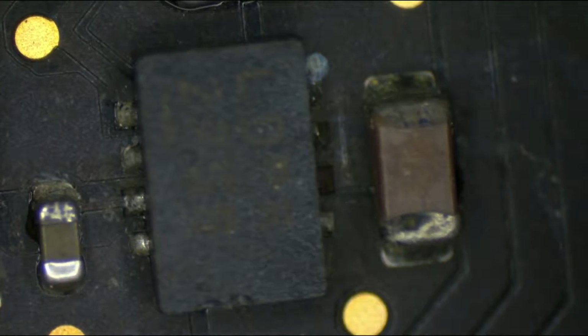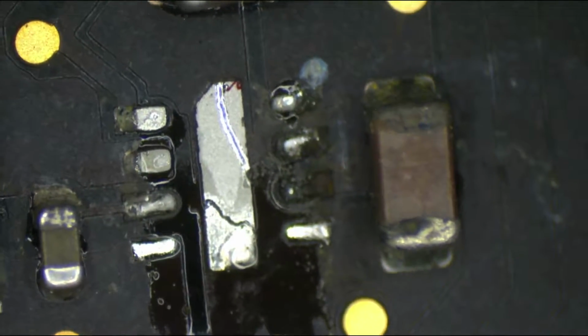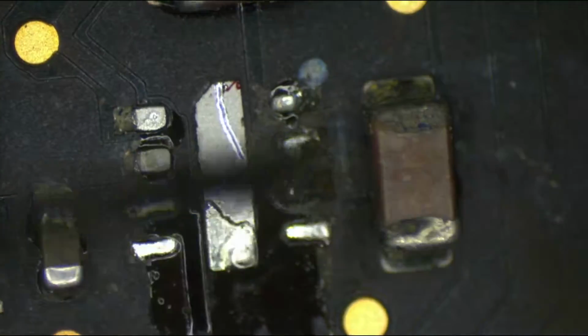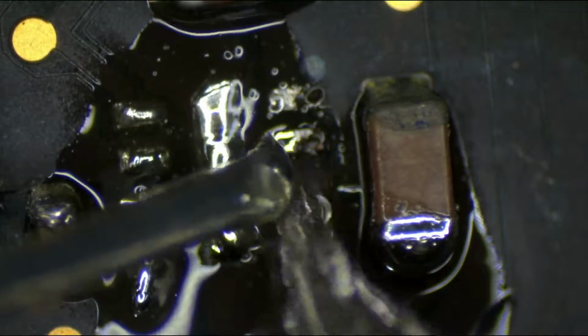One of my pet peeves about Apple products is they all have this circuit that is meant to take 18.5 volts from the charger or 12.6 volts from the battery and to turn that into 3.42 volts. They all have this, and every single one uses a different chip. Even though it's the same thing every single year from 2000, at the very least to my knowledge, every circuit from 2008 to the present is the same. It turns 18 whatever volts from the charger, 12 volts from the battery, into this. And they all use a different chip to do it, which is just, I don't get it.